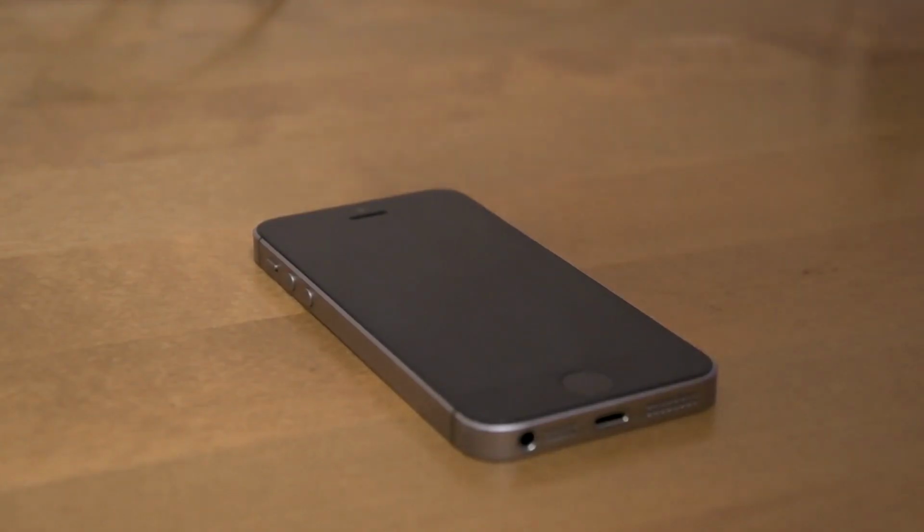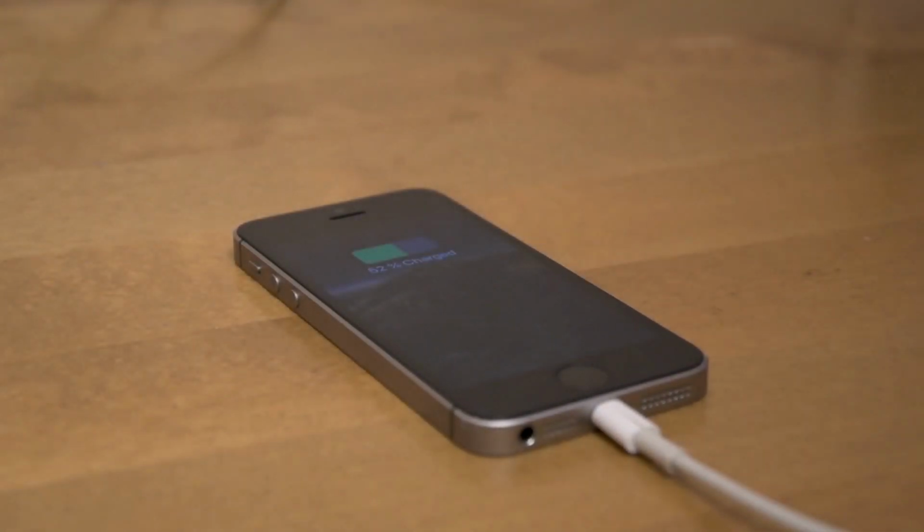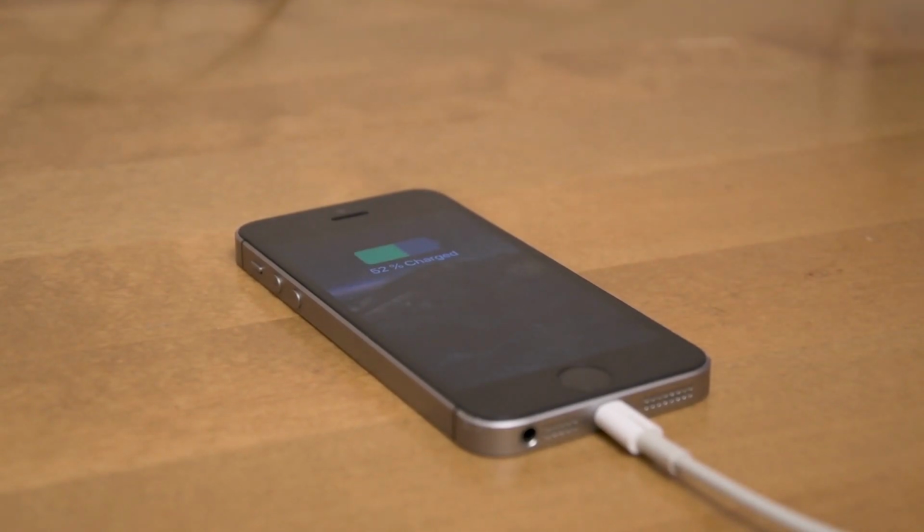I touched on it a little bit, but there's also this capacity measurement component, where you want to be able to say with more accuracy what the actual capacity of your cell is. The easiest way to think about that is if you've noticed your phone going from 20% to 5%. Your phone in some cases is measuring a voltage value. The voltage curves for a cell typically have a nice steady state in between its nominal values. But when you get to the end, you have either a major jump or decrease in voltage. That in turn is what shifts that capacity from 20% to 5%.